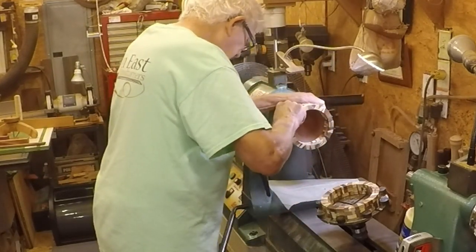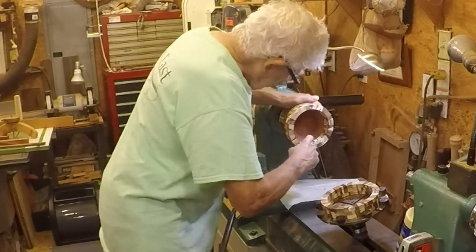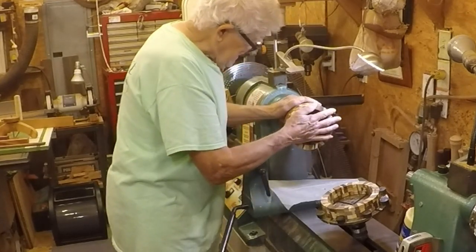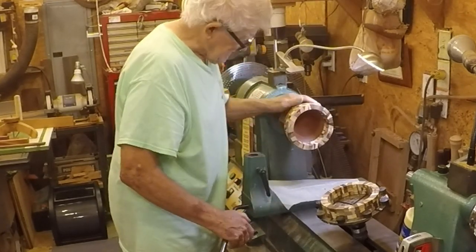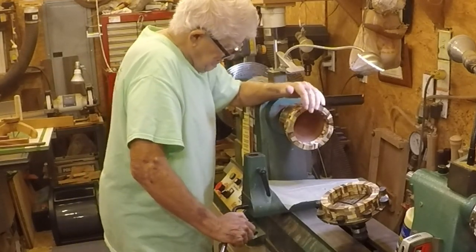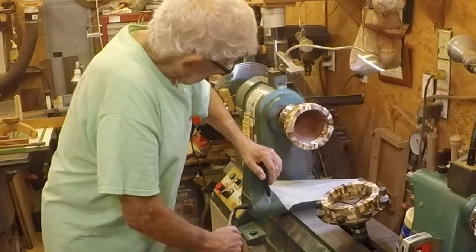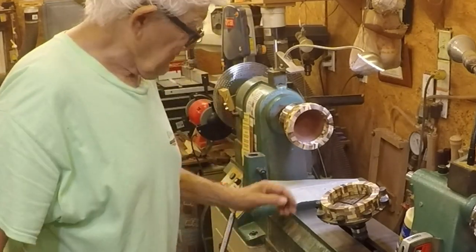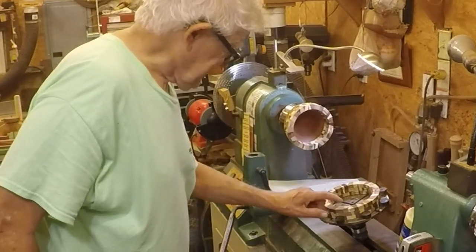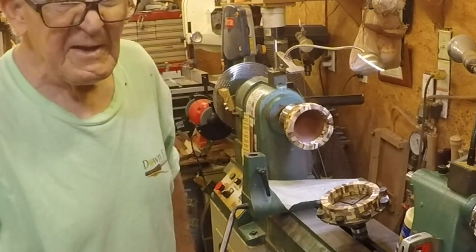Squeeze out's still a bit wet. Still, right there you can see it. That's okay. I've already got the inside turned. Got the edge turned and flat, and I'm ready to glue on the second ring. Thinking this is going to be too tall. Probably will be, but I'm going to do it anyway. So I'm going to go ahead and just do the same ring the same way. Just make sure I get the joints offset so they're not lined up.